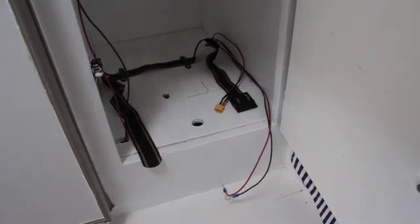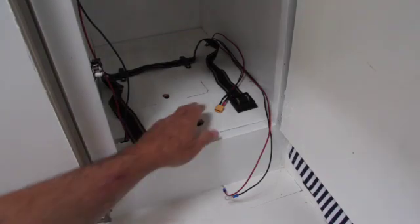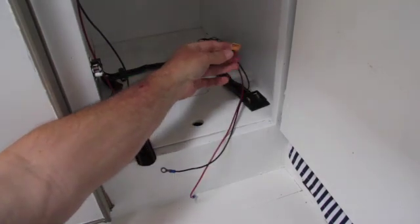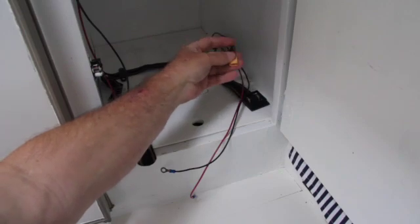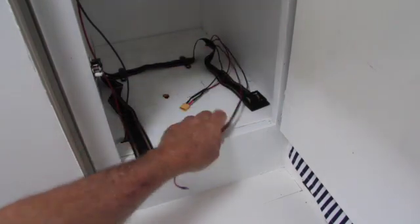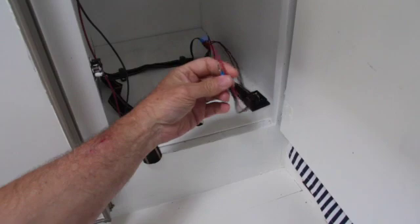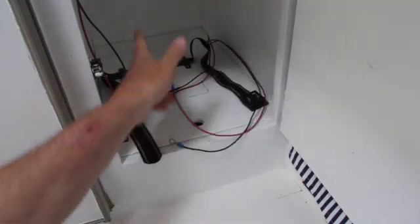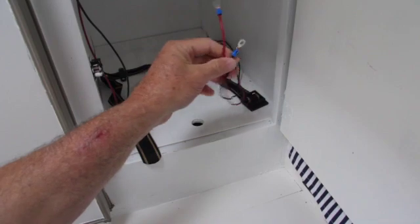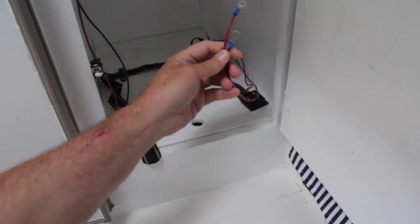We're inside the camper now and I have a little cupboard here that I'm going to use as my battery storage. I have a tie-down for the battery mounted and a couple of leads — this lead has an XT60 connector that goes to the connector on the battery box and runs down to my power converter. I also have two leads with ring terminals that go to the batteries wired in parallel; these run to the exterior of the camper and are wired directly into leads on the underside of my pickup truck into the cab so I can run my battery charger.